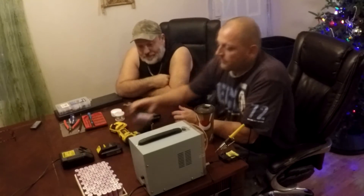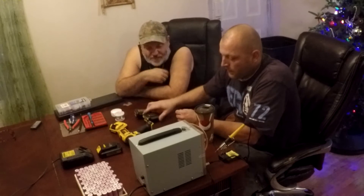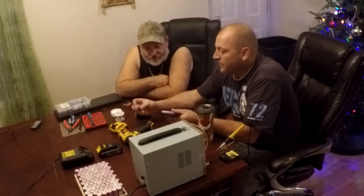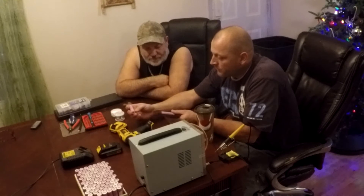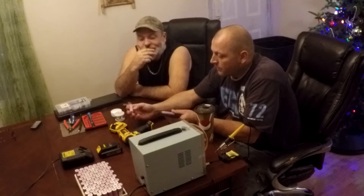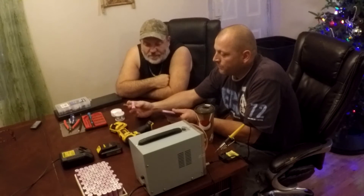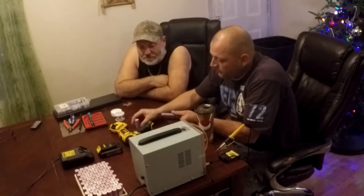So the goal is to take some lithium batteries — 18650s — and replace the ones that are inside. Where did you get those batteries? These batteries came from laptops. These are recycled batteries. They've been put through a test bench that runs cycles on them — voltage tests and capacity tests. This one, for example, started at 2.6 volts after it was ripped out of the pack. After running it for three cycles back to back, it shows a capacity of 2,399 milliamp hours, which is pretty good. This is a 2,600 milliamp hour battery to begin with, so it's 201 milliamp hours less than rated for new — not perfect, but pretty good. Inside the drill battery pack here is three of these cells.